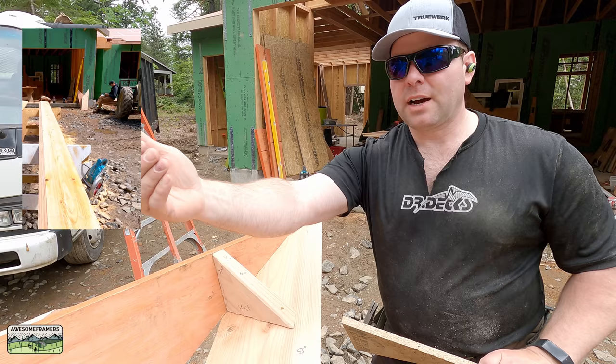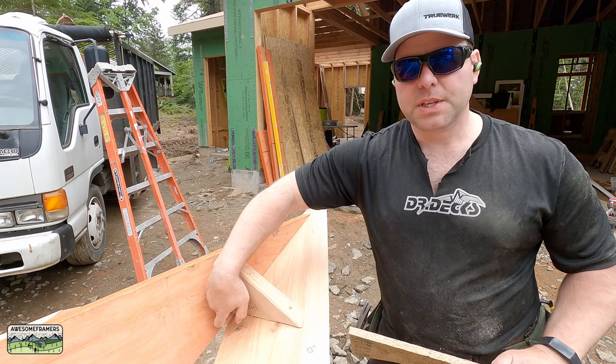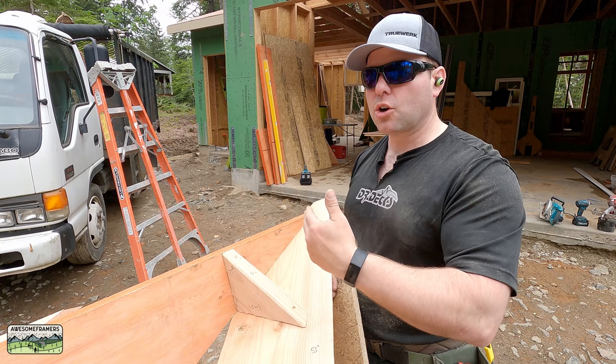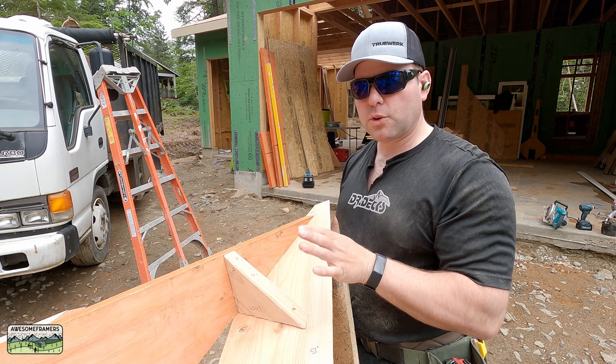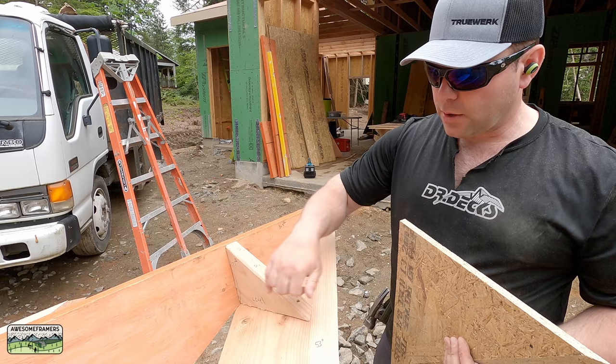Instead of pulling layout from the gable for California jacks, we pick an arbitrary 12 inches, which makes this bay pretty small — basically from plumb to seat. We could have easily gone 16 inches; it doesn't matter. From that 12-inch we can calculate with the BuildCalc app how much each jack gets longer, adding that to 12 inches all the way down until we get a length close to our last common rafter. Make sure you get it right — I just re-cut all of them because I punched the wrong number.